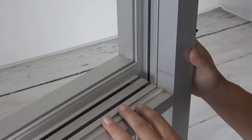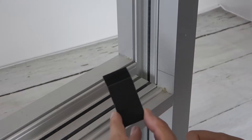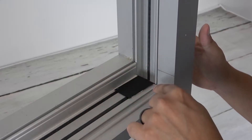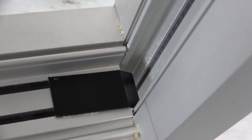When the horizontal mullion connects to the vertical mullion, it's going to leave behind this little gap right here. And that's where the water diverter is going to come in. With that little angle, and when it's installed properly and caulked all the way around, it's going to make sure that the water just keeps flowing down through the system. Since these systems are designed to funnel the water through the verticals, we know that the gap will definitely see some of that water. So we want to make sure that water is flowing as fast and as easily as possible and gets out right away at the bottom.